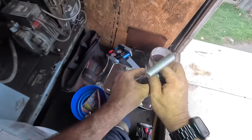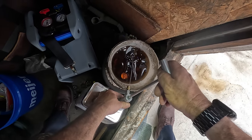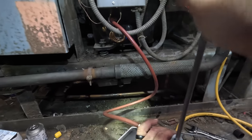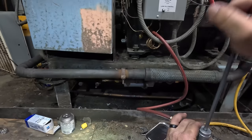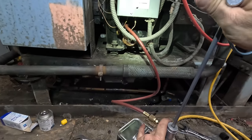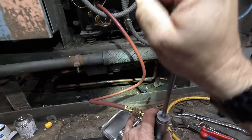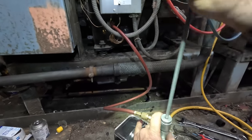Time to pump the oil in. I like to bleed — I pump out for the first couple pumps to make sure I don't have any old leftover moisture-absorbed oil in there. There we go. I'm going to fill her up a half layer. Back in the day they wanted less than 3-5% old oil left in there and you'd use a refractometer. Of course I was never doing those systems back then, so I don't have those refractometers. But it was later found out it didn't have to be quite that strict. They originally told us that if you took a cup of PoE oil and let it sit out in the atmosphere for 15 minutes, you'd have nearly double the moisture. Now, it does absorb a lot of moisture, but if you want to use best practices, try to be as quick as possible, limit the exposure — but it's not as bad as what they originally said. Your vacuum will not get the moisture out of the oil for the most part; your dryer is going to be used for that.